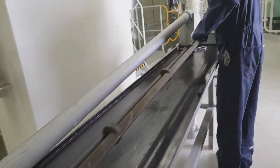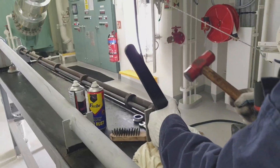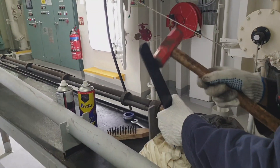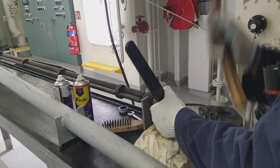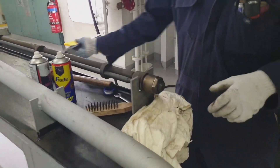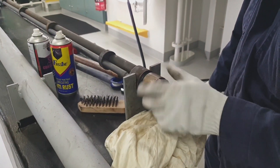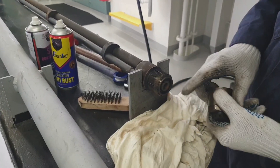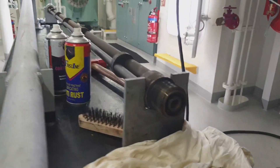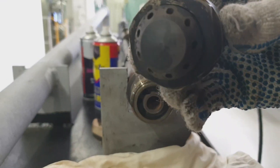As you can see, this is the overhauling stand of the main burner. By hammering, just unscrew the burner cup nut — just like that — and unscrew slowly. As you can see, this is already detached: this is the face and this is the atomizer tip.